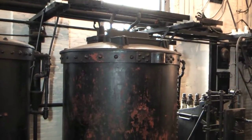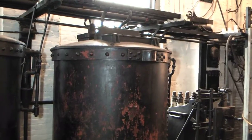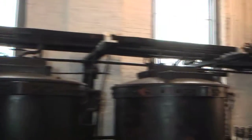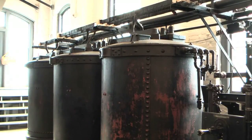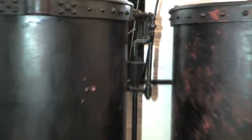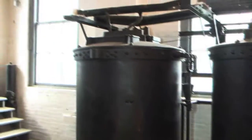These are our second generation transformers in this plant. They take the 800 volts that we're generating off the generators and boost them up to 11,000 volts. They're taken upstairs to a switchboard where they're sent out on the line from the upstairs loft of this building. The upstairs loft was primarily a switching and transformer loft, and these transformers were actually put in later to facilitate rearrangement of the transformers they had upstairs.